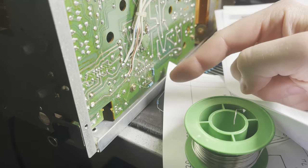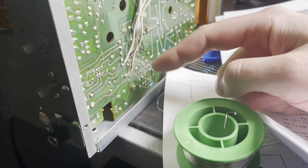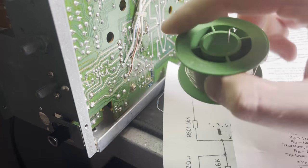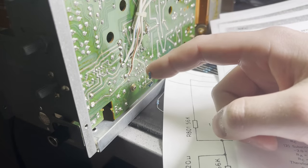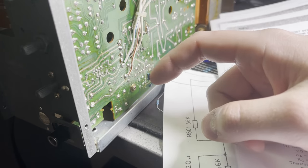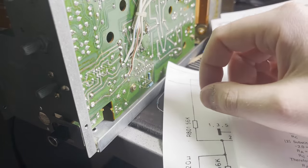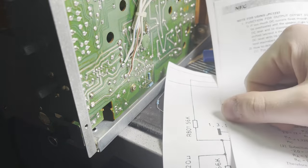So these two jankily put in resistors are replacements for the resistors that used to be there. I'll put this in properly, but this was just a quick and easy test, to see if the theory worked. So, I almost fell. So, these are, I think, 150K ohm resistors, and what was in here was 56 kiloohm resistors. So, the threshold's quite a lot bigger now. The 56K is what, even on the IC itself, that's what they recommend.